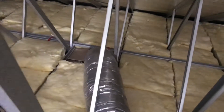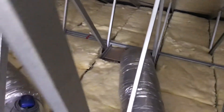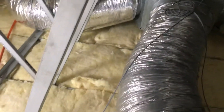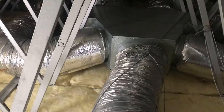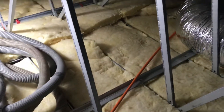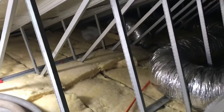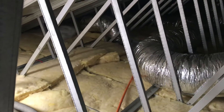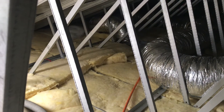Imagine over the whole job there's a lot of steel conducting heat. There are also some gaps around the place where the ducting doesn't quite fit properly. Anyway, I'm going to go through and do the downlights, then pump this job with cellulose fiber insulation. That's why I don't recommend batts in any house, but I definitely don't recommend them in steel frame houses. Like, comment, subscribe, share — I'm going to get in and do the prep work and get this job done.